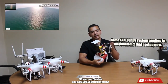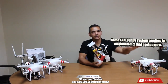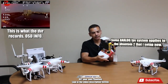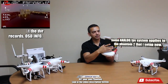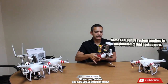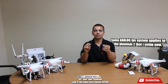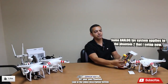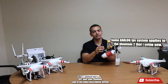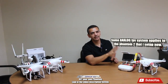I also have a little DVR — I'll be posting a link to that too. The DVR records all the OSD data: altitude, satellite locks, speed, everything about where the Phantom is. I also have this little bracket so you can mount the FPV TV. This battery powers the TV and the video transmitter, with one cable going to the FPV TV and the other to the video transmitter. I'm using a 2200 milliamp-hour 3S battery, 11.1 volts — fully charged around 12.8 volts.